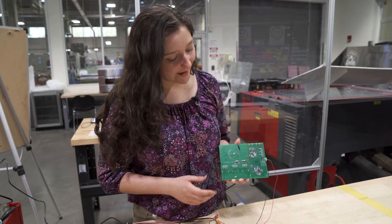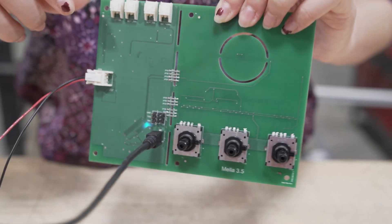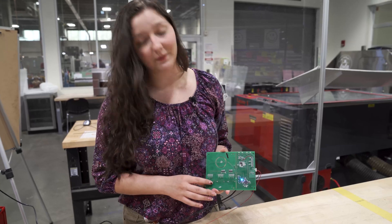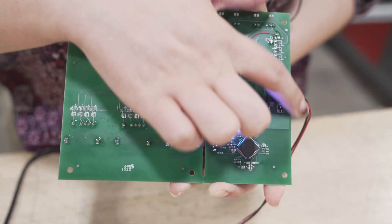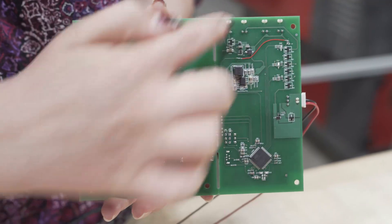Hi, my name's Emily. I'm working on the Mela redesign of the board. What I just did on this newest iteration is I extended the board a lot. I moved a lot of stuff away from the humidity sensor so that the temperature of the components won't affect the reading of our humidity sensor. I also added a reverse polarity protection circuit so that if you plug in the wrong power supply, the board won't explode. This should be our final version of the board.